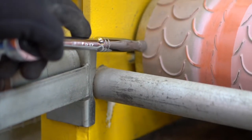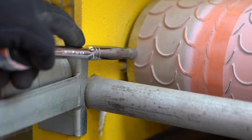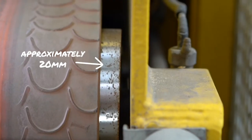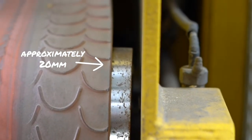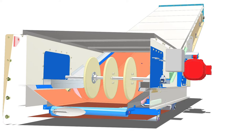So we look at the tail pulley and what we're checking for is clearance on either side of the pulleys and make sure it's running central on that pulley. The pulley is crowned so the belt will normally want to wander to the centre. What we're looking for is that it's running square to those Kiwi wheels.